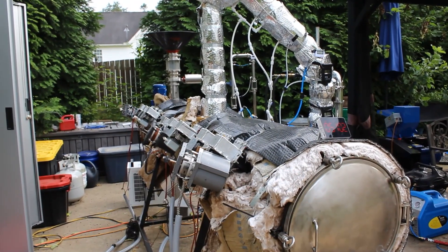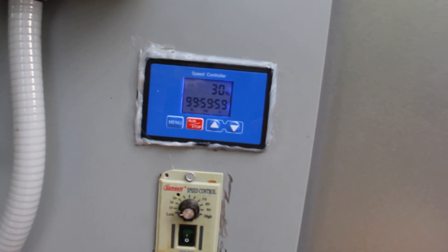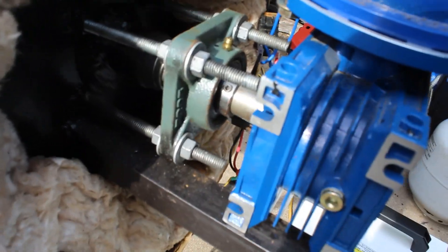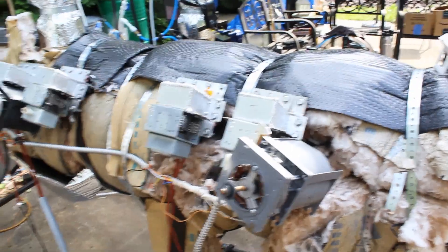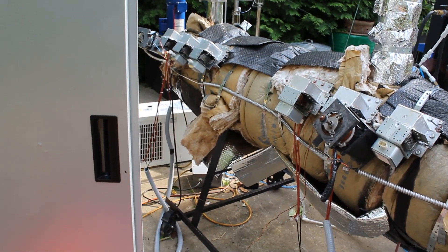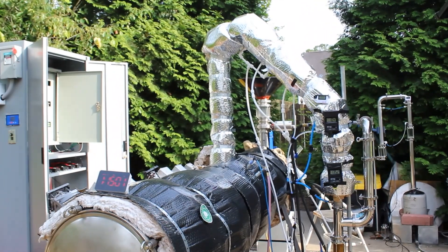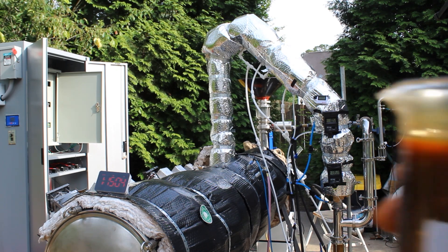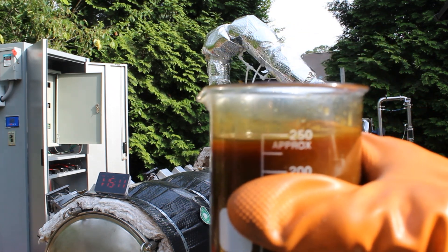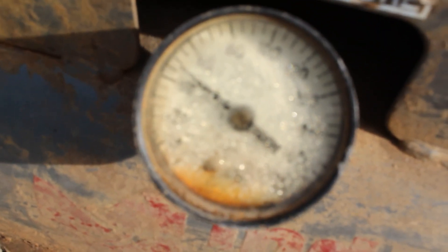Let's spin these blades for the first time — pay attention to this monitor. The motor pulls less than an amp because it's operating on 220V at only 23% power, so we're still only pulling 48.8 amps total. About an hour and 15 minutes in, we got 250 ml of oil. This used to be how much we'd get from several runs — a single run, just an hour in, 250 ml, a quarter of a liter. The tank is about 45 PSI.